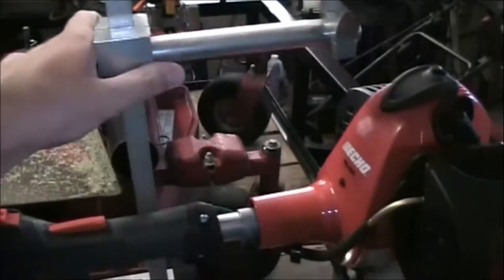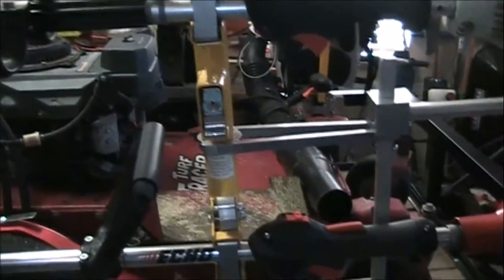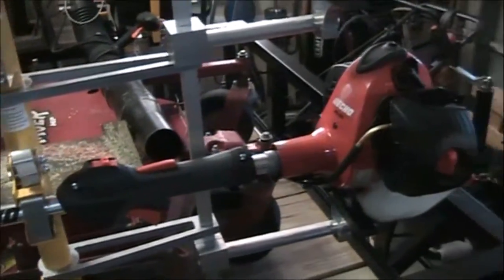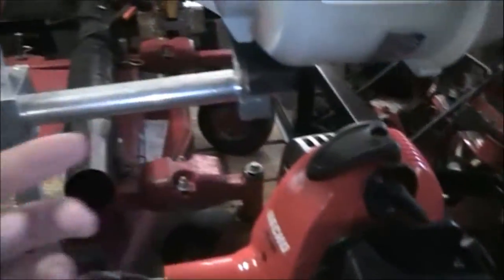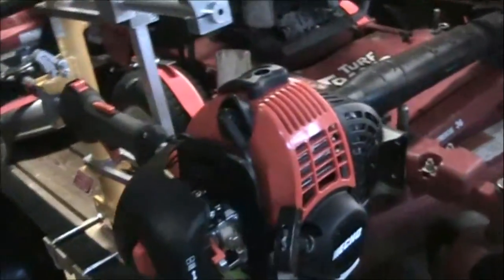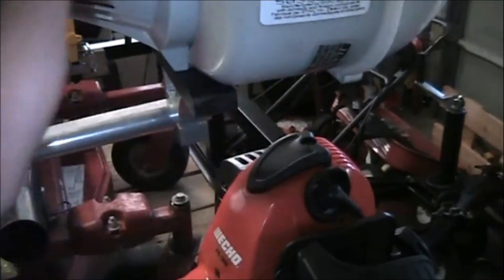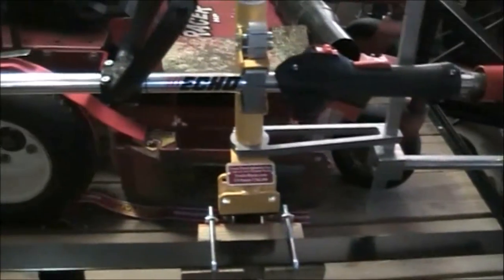I need to repaint that area, but I'm really satisfied with these racks so far. I'll be mowing tomorrow so I'll see how they work. I definitely recommend getting the engine support kit. Skag Man on YouTube made a video called 'Green Touch Trimmer Rack Warning' where he had an FS94R snap off at the shaft — this was before he had the engine mounts. Since the rack holds the trimmer so tight, the engine — which is back here — wobbles and can break the shaft. With the mounts on, these don't move at all downward, and I positioned mine so it's pushing up slightly so it can't move.